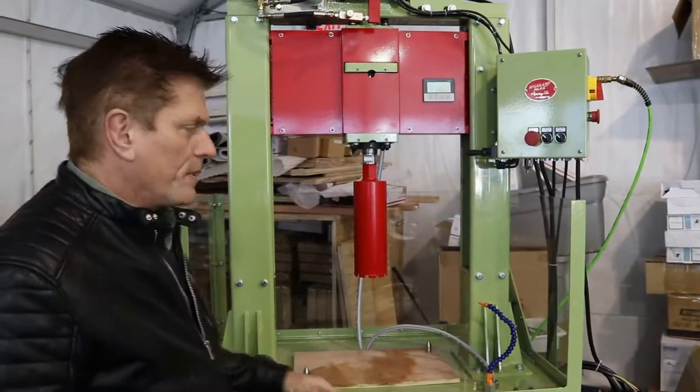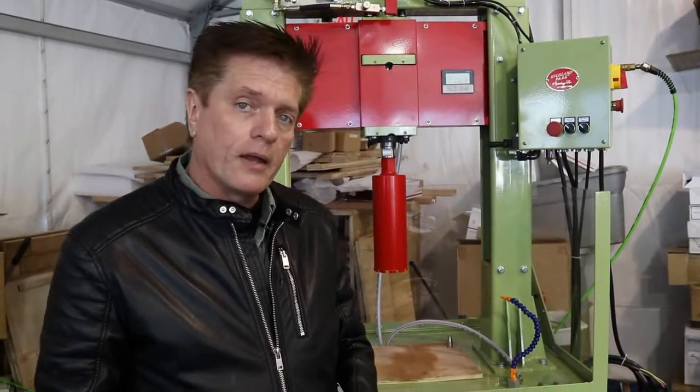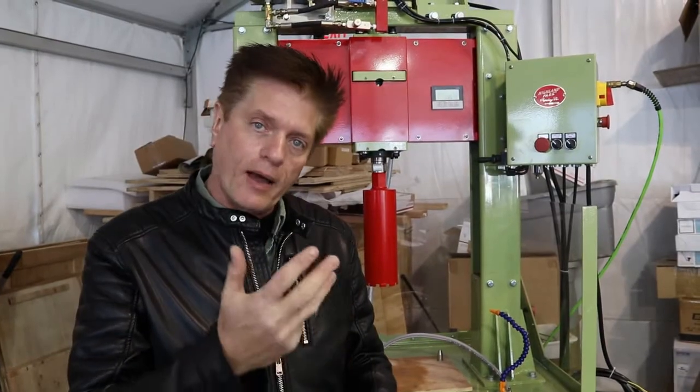The core drilling we've been doing for probably 20 years or something like that in our sphere cutting operation. As many of you know, we also sell spheres to you. And the core drilling allows me to take one cut, pull out a core, and then through a series of jigs, core that core either 3 to 5 more times so that I'm coming out with essentially a round ball. A little bit of angle grinding using one of the wet grinders and a turbo wheel, and then right into my sphere machine for cutting.